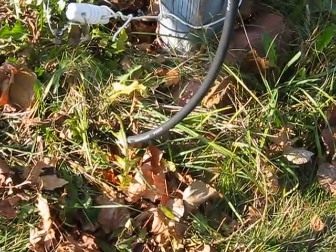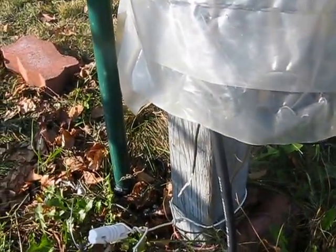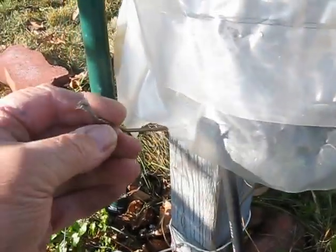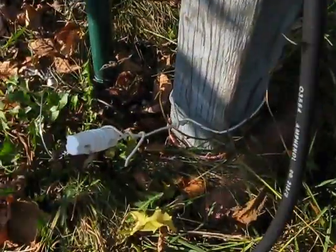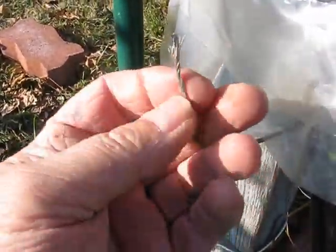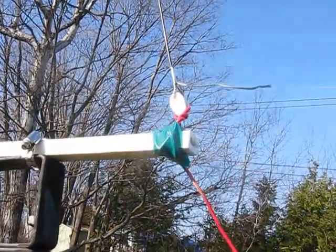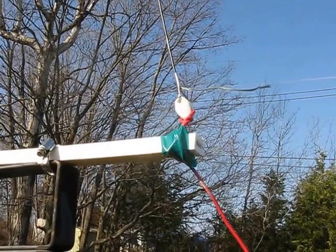That carries the RF to the tuner, and this is the feed for the wire — a single wire. There's ground down here as a counterpoise, and the single point is going to go up here and attach at that point. I can put in a coil or whatever I want in there.